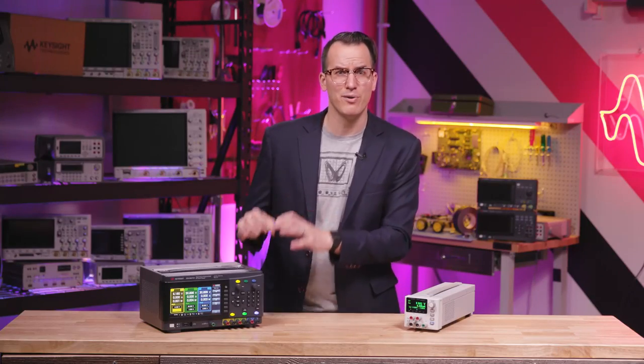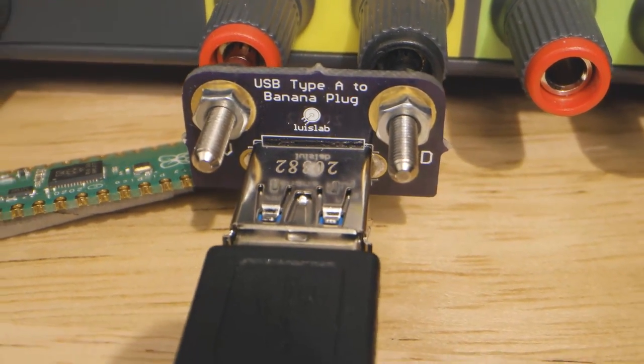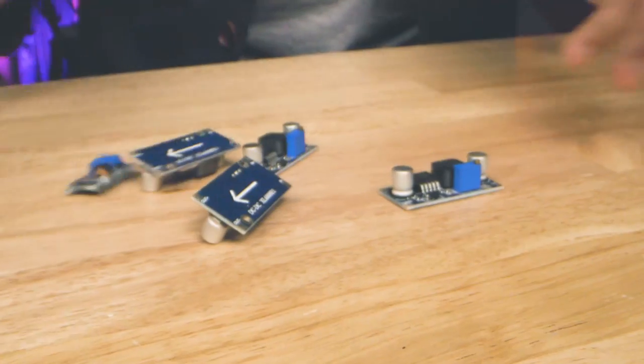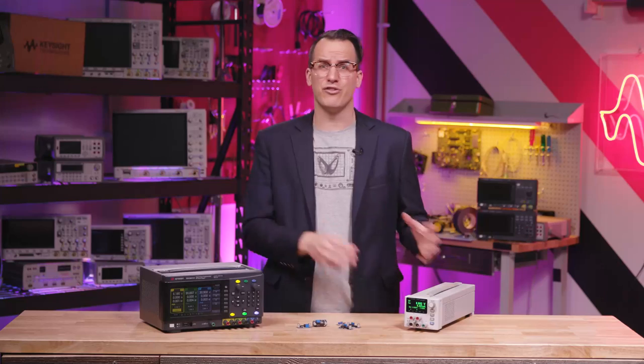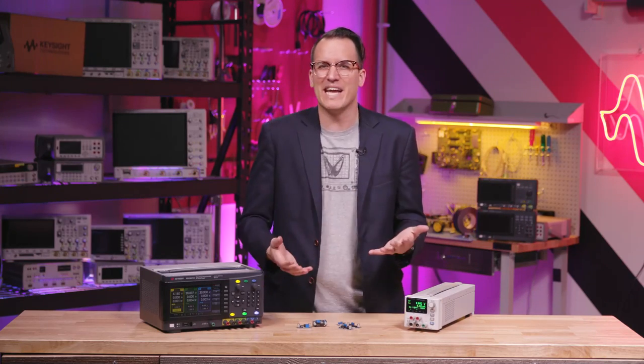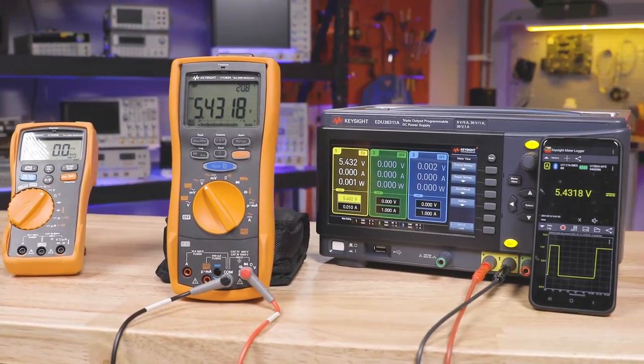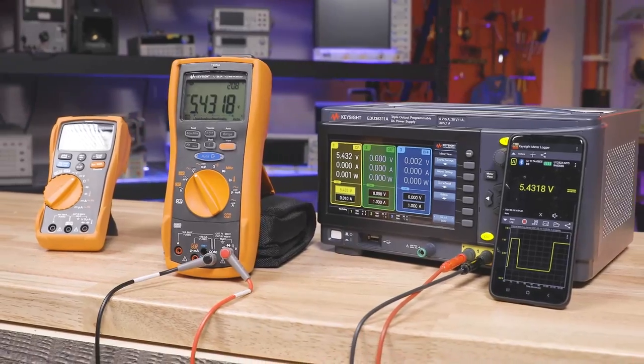If you're doing USB powered devices, I really like this design from Lewis Lab — you can bring up your device through a USB cable without accidentally zapping a computer or running through a wall outlet. Plus three points if you have a benchtop power supply, and plus two additional points if you have at least three outputs. I also like to have some cheap boost and buck converters on hand; they're cheap enough and small enough to go into a one-off project or prototype.